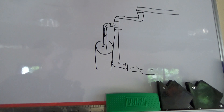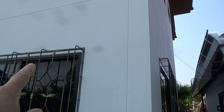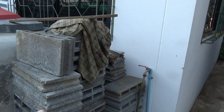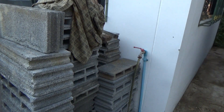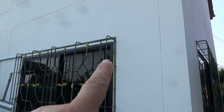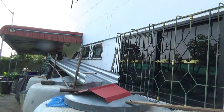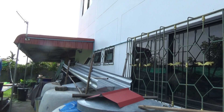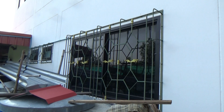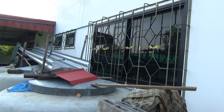Just this year we'll catch a lot more. Here's where it's going — I'll have a pipe come across to here, to the edge of the window, and then down. I'll have to move all these blocks. My clean-out will be down here, and then I'll have a tee off here to come over into the water tank. I've had this tin on here ever since I put the water tanks there — it's caught a ton of water — but I won't need it anymore so I'll take it down. This will be more than enough water; the tank won't even be able to accommodate water as fast as it's going to come. These tanks will overflow very quick, but that's okay — the tank will be full anyway.